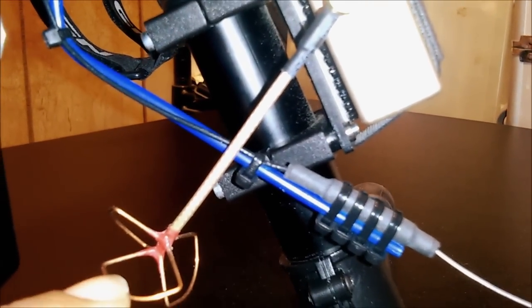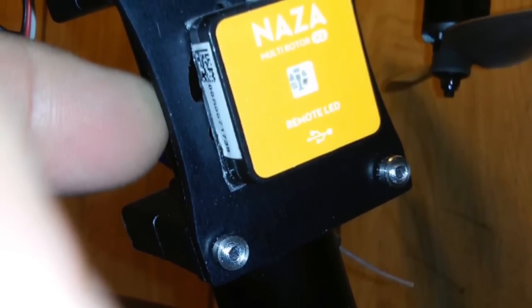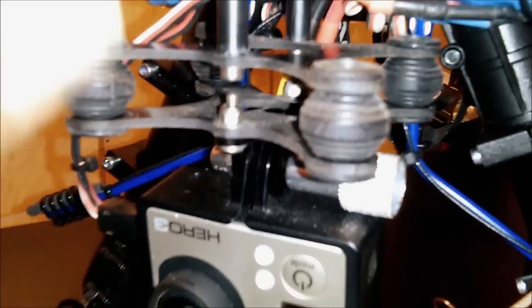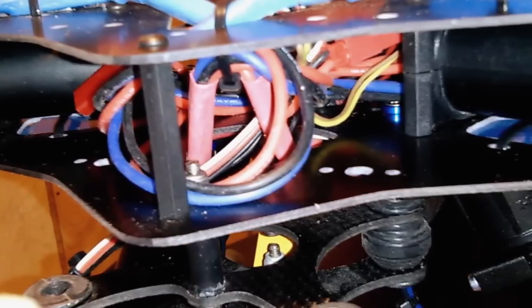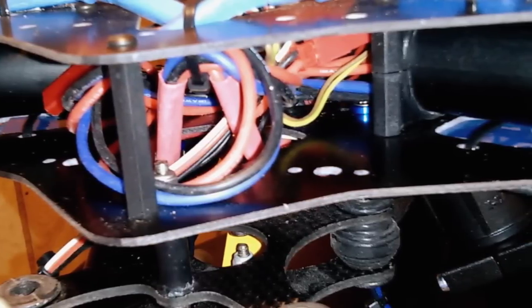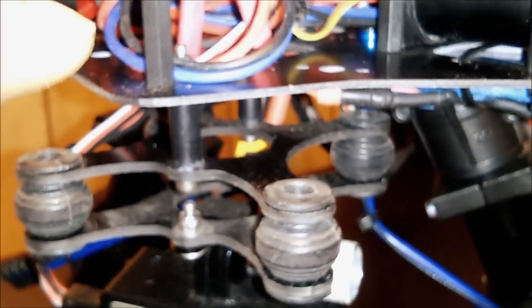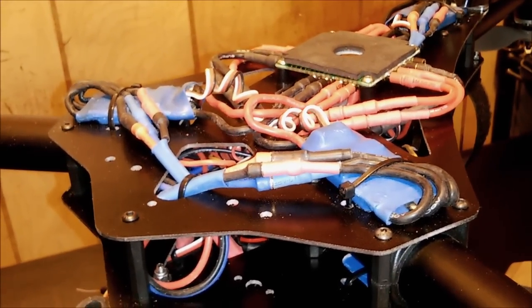The antenna on the video transmitter is a cloverleaf for 5.8GHz equipment, made by Quad Frames. The boom blocks used on this aircraft to hold the video transmitter and the Naza LED light are also made by Quad Frames. The camera is mounted with an anti-vibration mount designed for the DJI Phantom. This aircraft comes with holes that allow you to fit any camera mount or gimbal designed for the DJI Phantom, as well as holes for 12mm tube-style mounts for other types of gimbals.